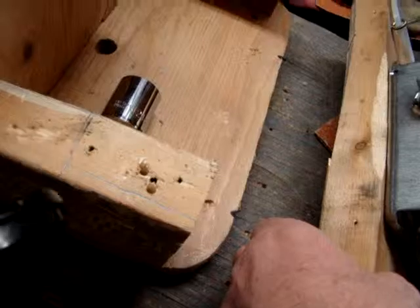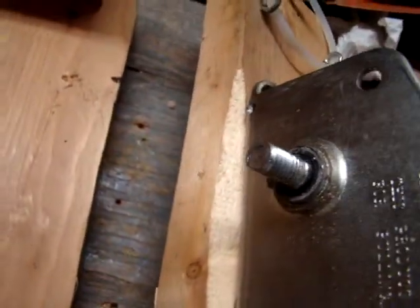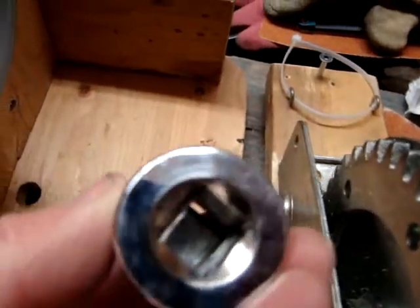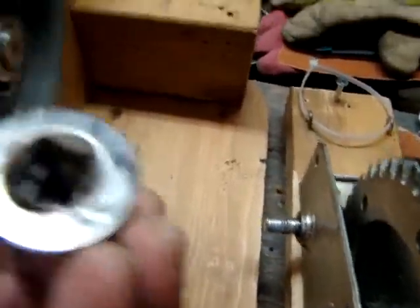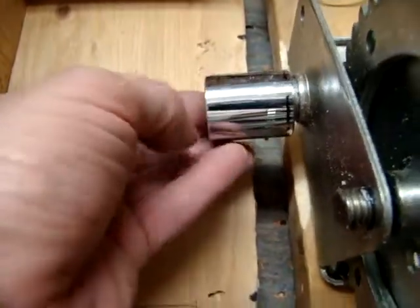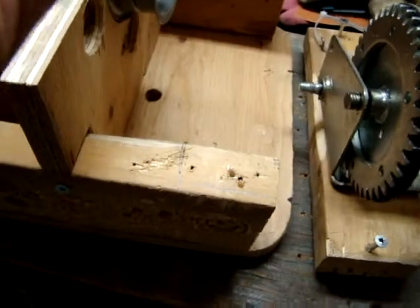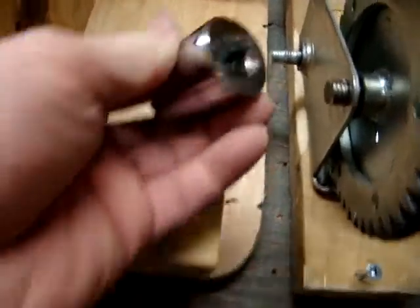The gear drive is actually not square — it's actually elongated. I don't know if you can see it there, but in order to make that fit, I've had to put an insert inside the end of this thing, so that it in fact becomes three-eighths by one-half. It's not three-eighths square, it's not one-half square, but it's three-eighths by one-half. And that will go on here — so, like that. That's right in there.